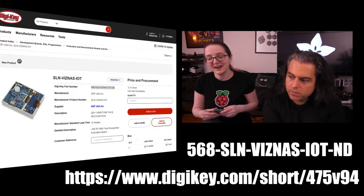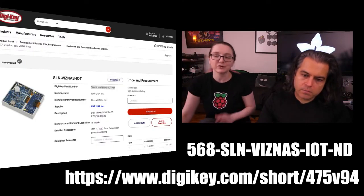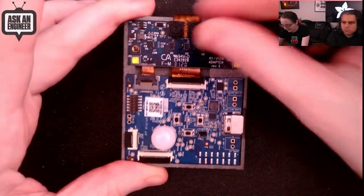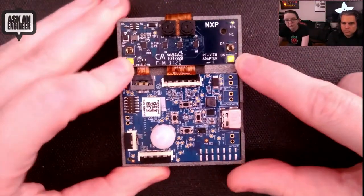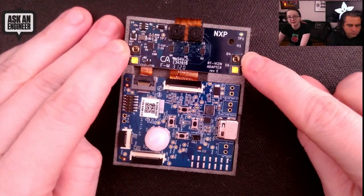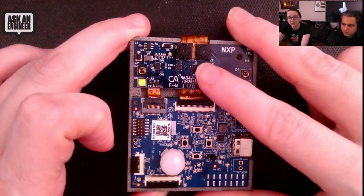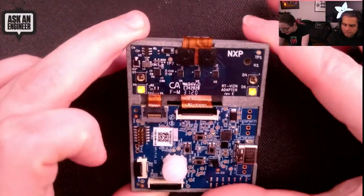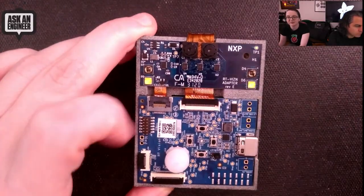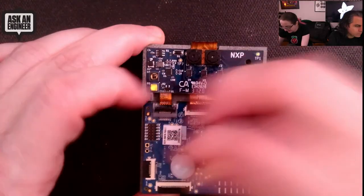Come in with a smile on your face! Alright, let's show this on the overhead and then we're going to play a video from NXP. So this is the dev board — this is the camera interface. You can see there are two white LEDs to illuminate somebody's face, two IR LEDs, and two cameras. You can kind of see one has a slightly different filter on the lens — this is probably the one with the IR cut filter. And this milled-out piece of plastic is the PIR sensor.